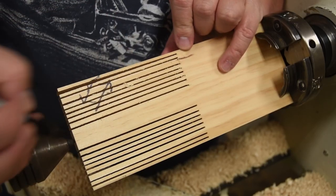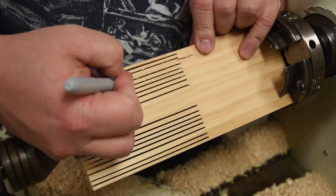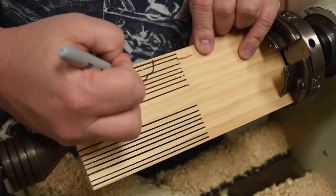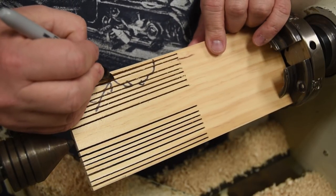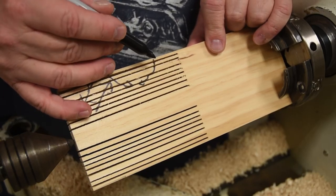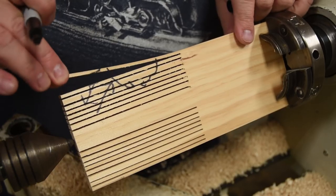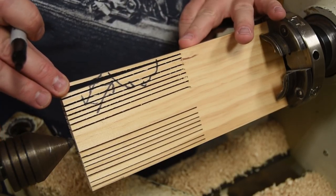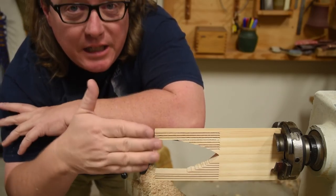That is why when we cut a cove, we will cut down one direction, and then we'll come down the other direction and kind of fidget in the middle. It's never coming all the way in and then coming out, because you'll get a massive amount of tear out and it might even split apart whenever you're coming down, because this end fiber is not supported by something behind it. But there are other ways woodturners turn the tree when it's laid on its side.